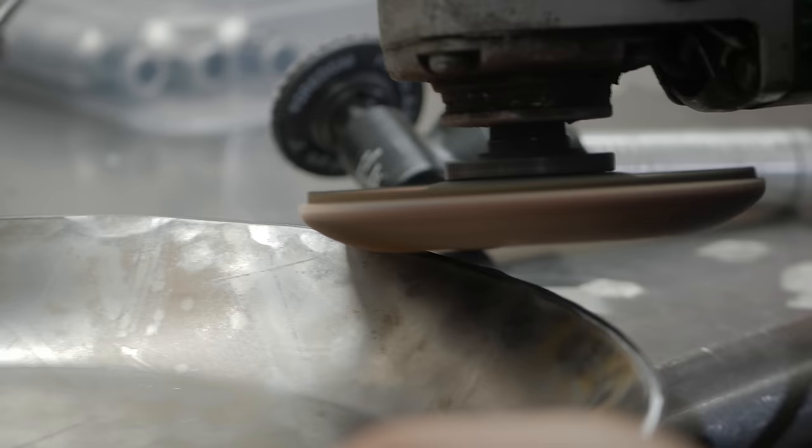So we're going to make handles for these pans that Tristan's been working on. My name's Bill Godwin — I'm a blacksmith, pan maker, skillet maker, kitchenware maker, whatever you want to call it. The first part is just getting these things all heated up. We usually do three or four handles at a time so that once they're all heated up, when you pull one out and work on it for a minute, it cools down — then you can throw it back in and another one will be heated up. Pretty much the rule once this thing gets fired up is everything is hot. So we're just putting a few marks on this to start; once it's cooled off, it's pretty hard to keep going, so that's why we've got the others heating up.